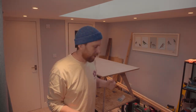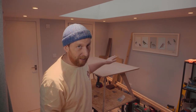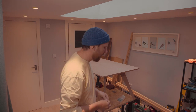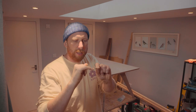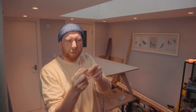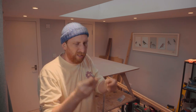This is looking really good. I filled in all the gaps and it's almost ready for sanding and then final finishing, but I want to do a bit of a dry fit. To attach the top to the legs I was going to use these L-clamps, but they're just really ugly, so I think what I'm going to do is cut them in half and drill another hole and use them almost like a figure eight — it's not a figure eight, but I'll make it work.